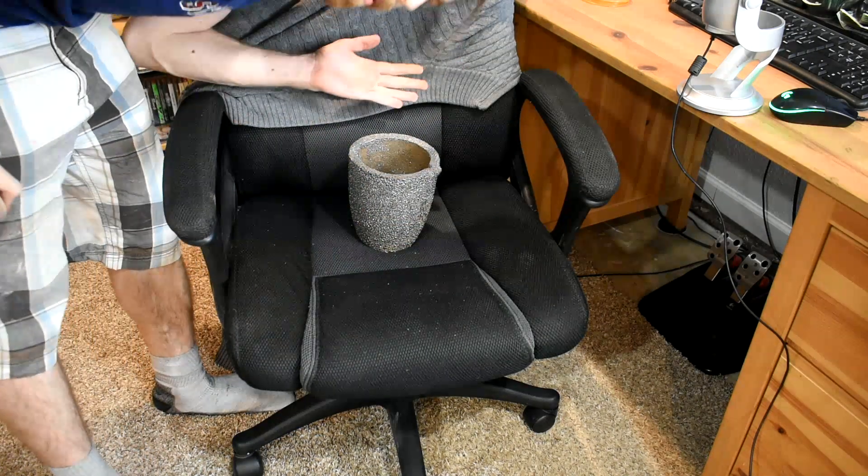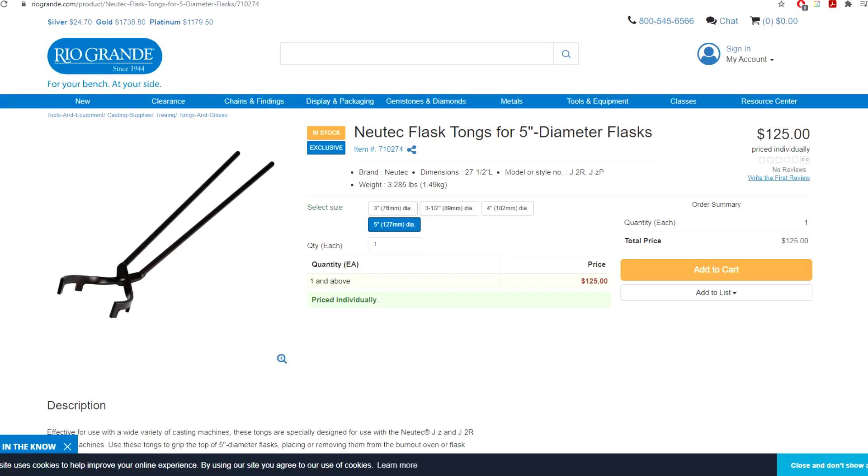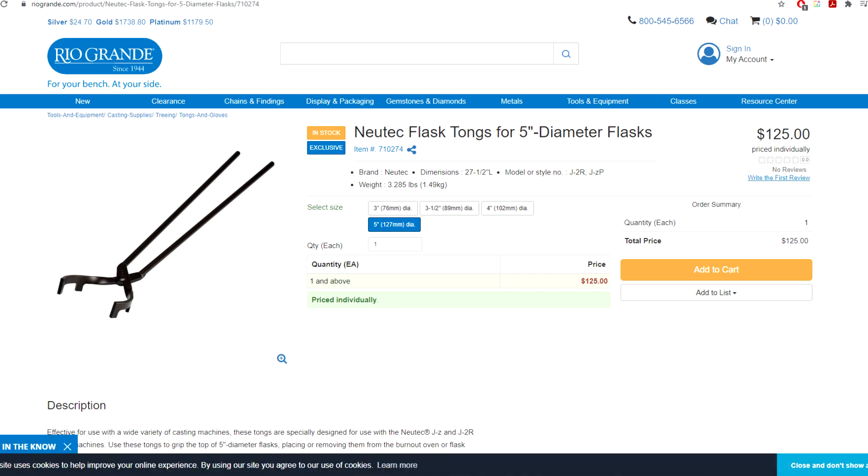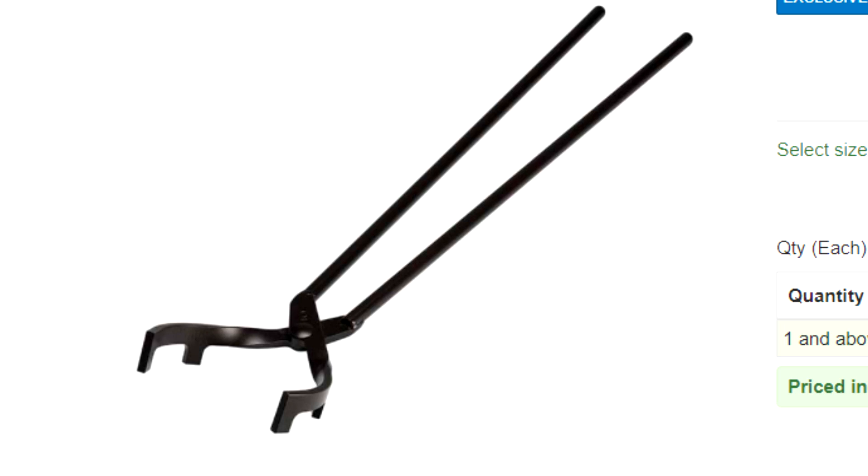It's nice not having hinges, but I'm going to need them. That leads me to something I saw for sale — these flask tongs. They're kind of a mix of the lifter and the Myford boy design. Since the jaws on the end aren't straight — they're not 90 degrees, they're at like a 45-degree angle — I could in theory lower that down into the furnace, grab the crucible with the tongs, and lift it up. It wouldn't be the best for lifting or pouring individually, but the handles — if you draw a straight line through them — go straight through the center of gravity of the crucible, which makes pouring much easier. So I'm splitting the difference between lifting and pouring, kind of like Myford boy's design but more simplified.